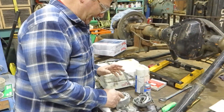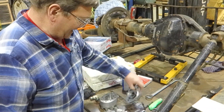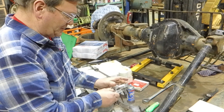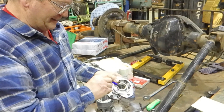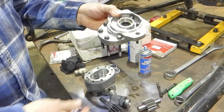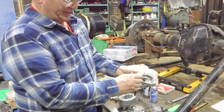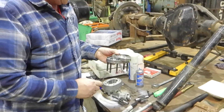We're looking at a hydraulic pump here — both for the fact that it's a hydraulic pump, and maybe you didn't know it, but one of the important things with a hydraulic pump, very important, you'll find a lot of times in repair jobs and stuff, the front seal blew out. This one didn't. This one had another problem: they cracked it on assembly. Somehow they got it crooked and cracked the ear. It split through and started leaking, so that's why it's here and apart.